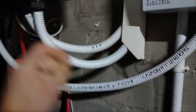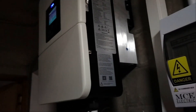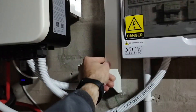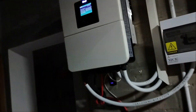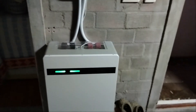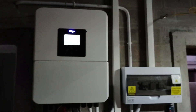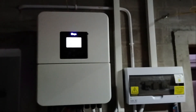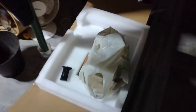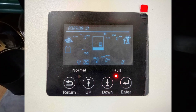Wire management still needs a bit of work, but it's on the wall and it's solid. A reasonably successful install — a lot more work than I anticipated, but I'm glad it's sorted. As for the old Lux Power, it's in the box going back. I did fire it up connected to a wall outlet at 220 volts and I think the motherboard has died again after being replaced — still giving error zero, which is an internal communications error on the dongle. So I guess I'm just going to sell that Lux Power.